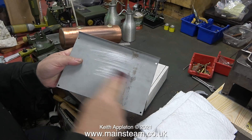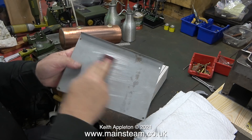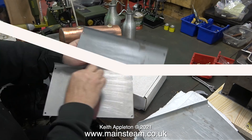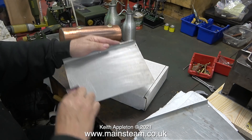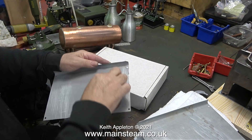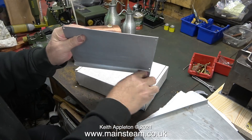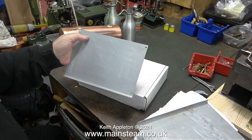While I was looking at the side panels I thought it would be a good idea to give them a light sanding with some emery cloth. This should provide quite a good key for the paint. I'm going to sand them a good bit more than you see on the video, but this is okay for starters. With the stuff I work with, keying is very important — if I don't key the paint then the paint will fall off.